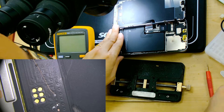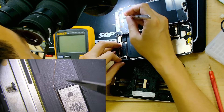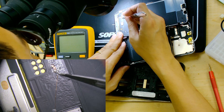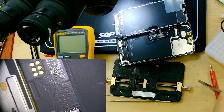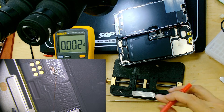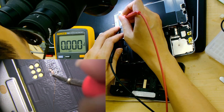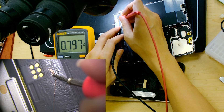If you're stuck on a problem, you're going to measure the next dot. From the left, number 8 — I got 0.8. Counting: 1, 2, 3, 4, 5, 6, 7, 8 — this dot. You're going to measure it with a multimeter. If you have an oscilloscope it's better, you can tell why it doesn't work. So number 8 from the left side, I got 0.8 — 0.79.